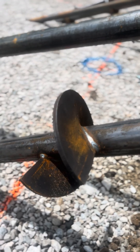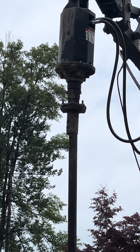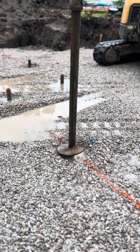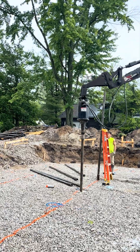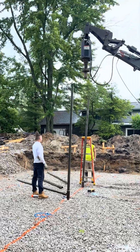You can see you've got those three different helixes on them. All those will embed down into that soil layer, versus just a bottom-bearing pier where you could just be pounding into like two feet of good ground and think you're good. With helical piers, you really have to embed multiple layers down into it to ensure that you're in a good soil layer.